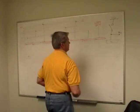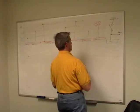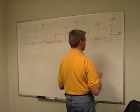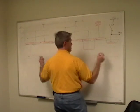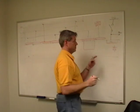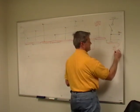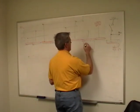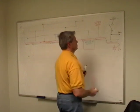So at some point, if I look at this in terms of the potential, well, he wants electrons, right? Electrons want to go there. I have moved my electrons to here, and this PN is a diode, right? And remember that a diode junction here, this diffusion, has some capacitance C. And here, I have stored some amount of charge.